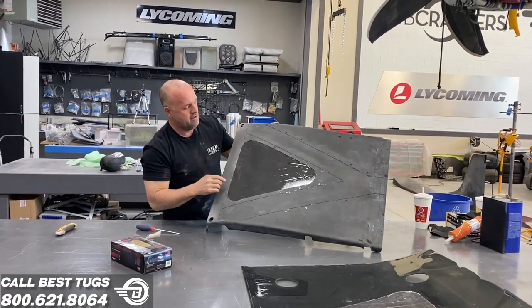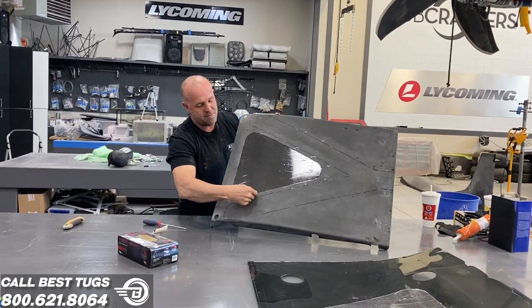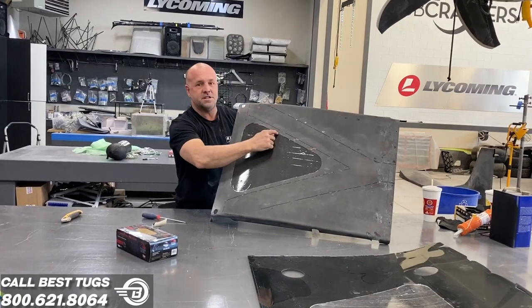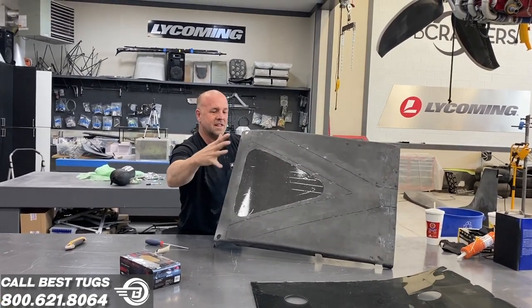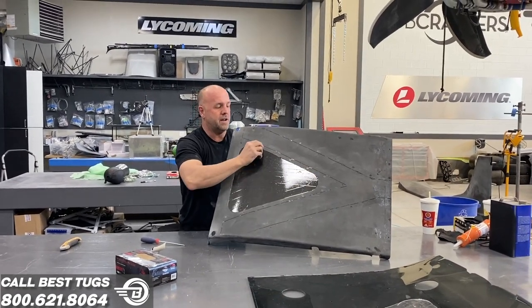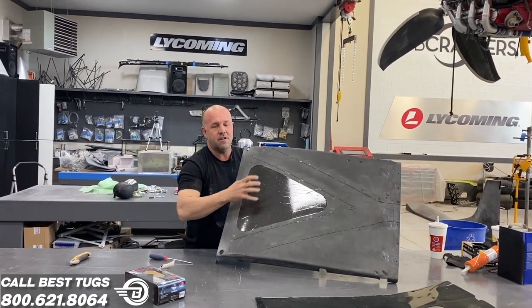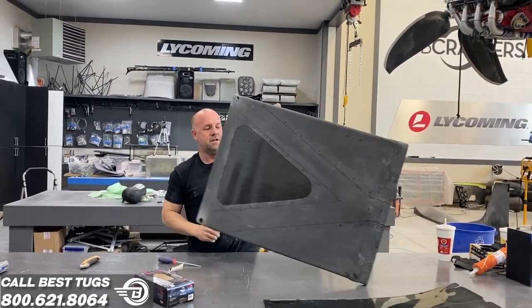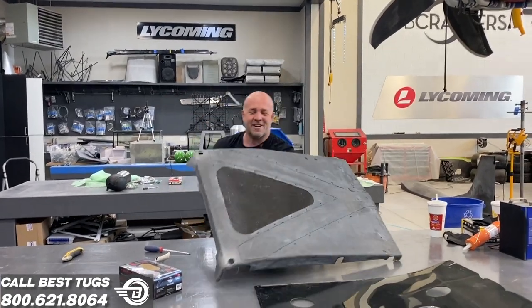This right here, I can now take, and I'll put a piece of half inch tape around this edge as just a guide, and I'll cut the middle of this out. I can set the acrylic in here, and I'll have the perfect reveal, about a 16th of an inch, the width of the blade I used to cut this out, and I'll put that in. So, pretty cool. So far, so good. Let's get back to work.